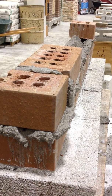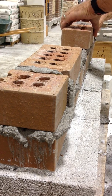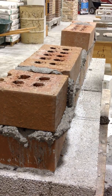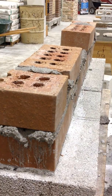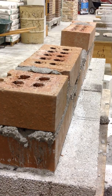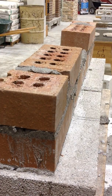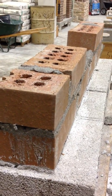You've got to butter. Hold the one brick and you have to squeeze the rest. Now get all the excess mortar off with your trowel. You have to do the cradling on this side. Be careful here with the head joints — don't get that first, then cradle. Don't forget this side as well.